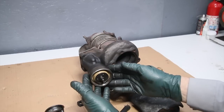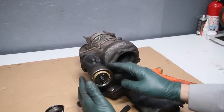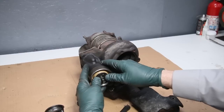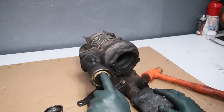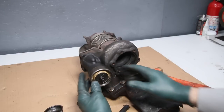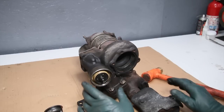So what's happened is the valve in here is totally seized in the guide. We're going to have to take this apart. You don't want to just bang on it and hope that you can loosen it up — you really have to take this apart and inspect it. This means that the valve is not opening at all, and it is possible that you could be over-boosting your engine. If the diaphragm is torn, which is the other problem with these, that could mean that the engine is not developing full boost. So these two issues could be directly related to the performance of your engine.